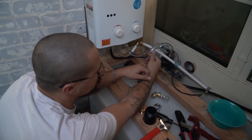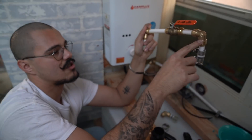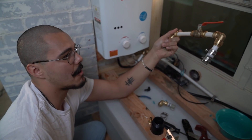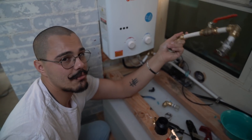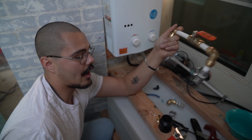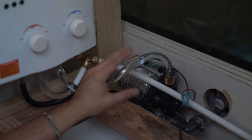I decided to go from the water pump to just clear flexible tubing, because I was having a lot of leaks coming from the sharkbites. A lot of people say they really like sharkbites, but so far I've had a really bad taste in my mouth with them. I've tried deburring them, I've tried really clean cuts, and they still leak. I don't know what I'm doing wrong. I've really liked the clear tubing because it's fewer joints, which means fewer places to leak.